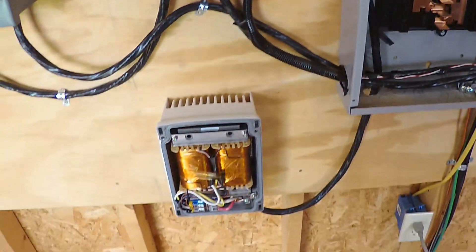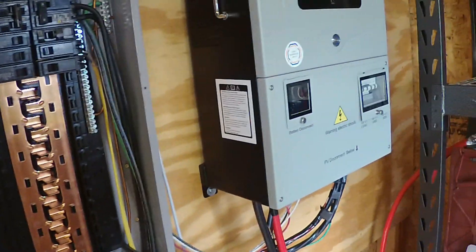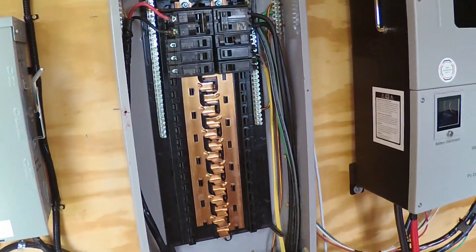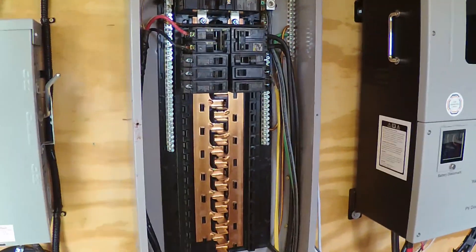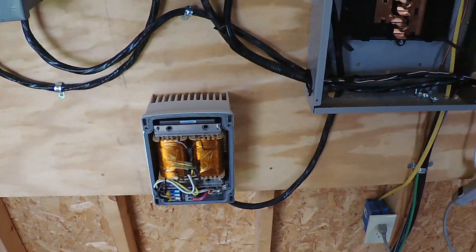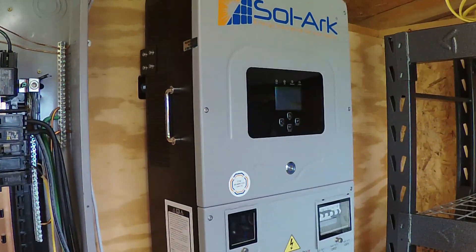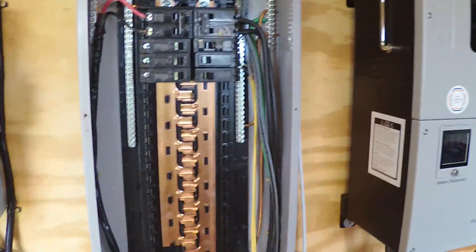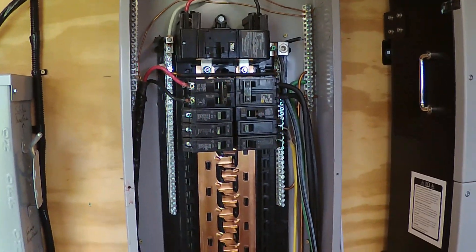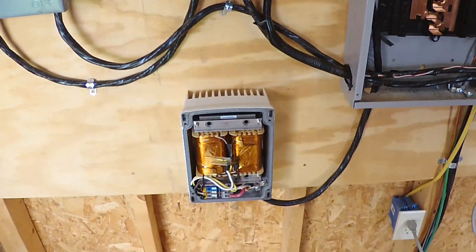When the breaker panel pulls off the solar it pulls a more balanced load. I'm running about 25 amps and 3,500 watts all off of one load leg, and I can look on the Solark and see it's splitting the load between the two legs. It's not perfectly balanced — still a little lopsided to the load leg we're actually using — but the point is it's doing its job: keeping the system running and keeping it from dropping offline. Normally we'll be running a pretty balanced load anyway; running off one load leg right now is just for illustrational purposes.